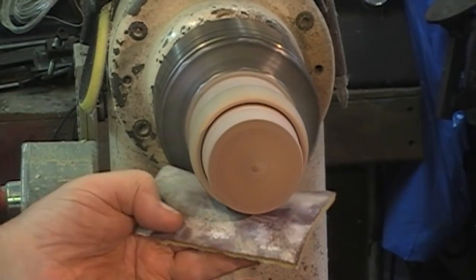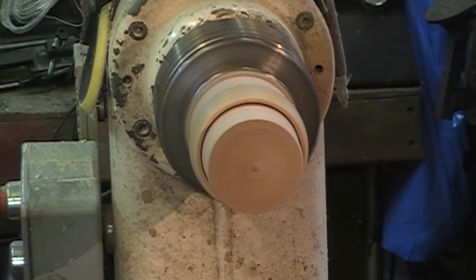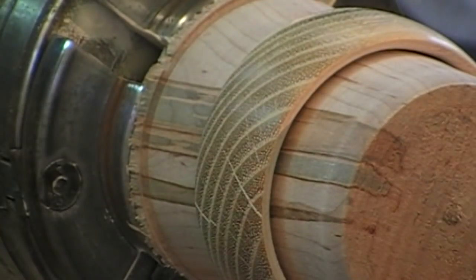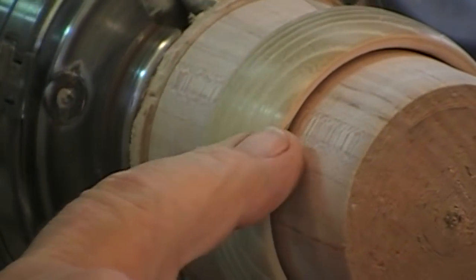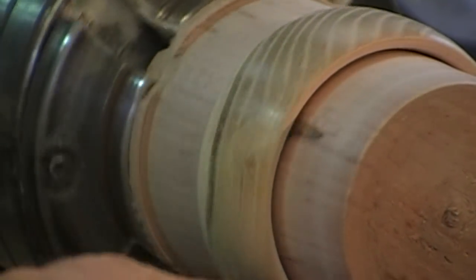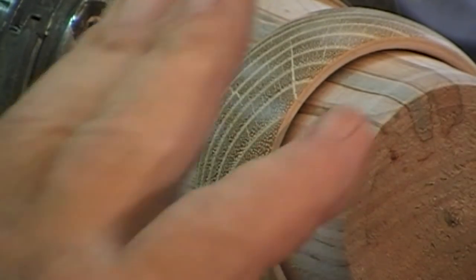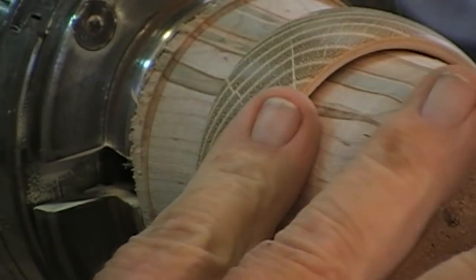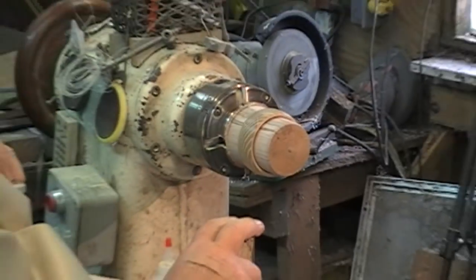Shields up. I've sanded it to 800 grit. You see the chatoyance, the sheen reflectivity of it, and you see some light cracks in it. Well, that's all the nature of the wood. It's going to be there. It's jewelry, but I've got it to 800 grit, and I'm going to start with sealing it and putting a couple of coats of sealer on it. Then I'm going to buff that, and I'm going to put some CA on it for a finish. You with me? You with me.